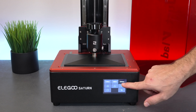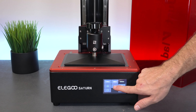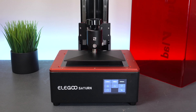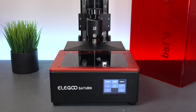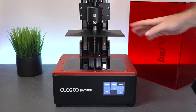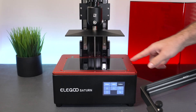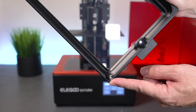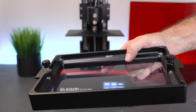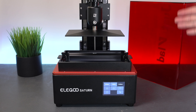That should be perfect right there — simple as that. Now we just need to raise the build plate back up. We have 0.1 mm and 10 mm increment options, so we click up quite a few times to raise it high enough. Leveling the build platform is not very complicated at all. Now we can put our tub back in — remember to peel off the protective layers on both sides. The tub has a little cutout for pouring resin out, and a max level line so you don't overfill it. Drop the tub in, tighten the fasteners on the side, and you're ready to go.